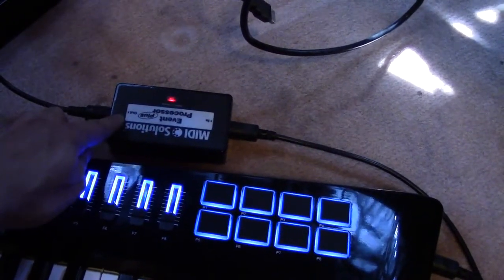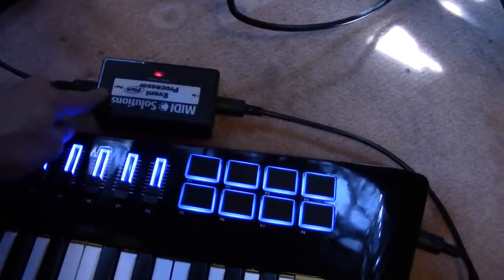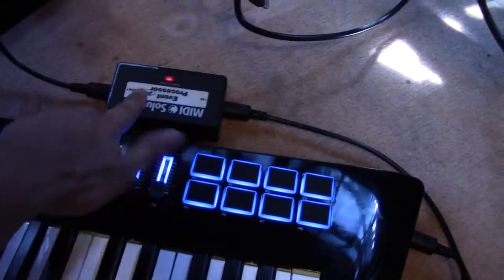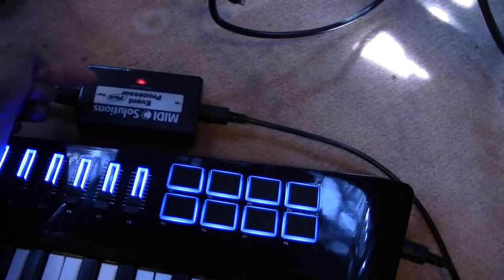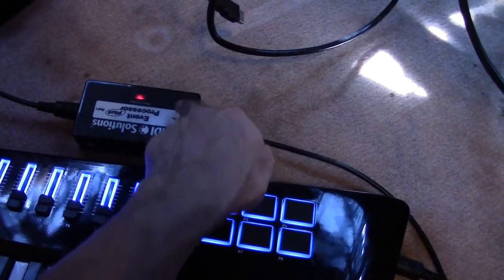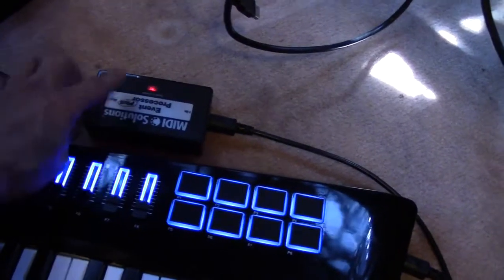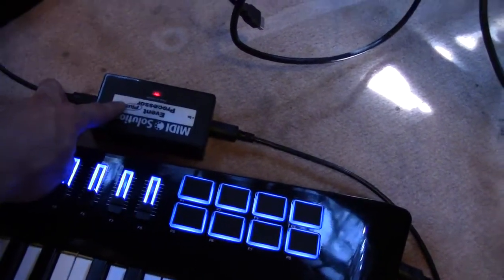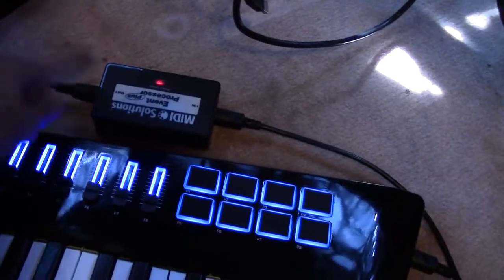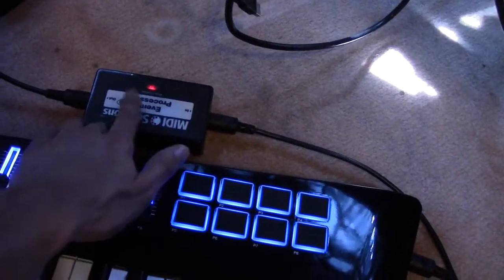And that would usually work, because MIDI out would send power. But an out going into an out, I don't know why, but it did not want to be programmed by receiving power from the out and programming from the in. It has to receive power and the programming from the in. The out doesn't have anything to do with the actual programming. The only time for out is after that's done, so that the message you send into it is changed into something else and continued out of it.